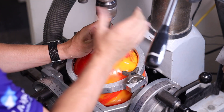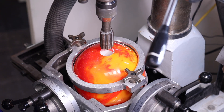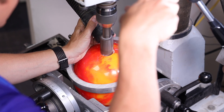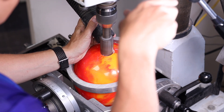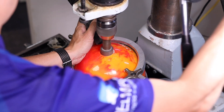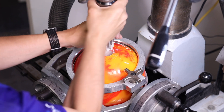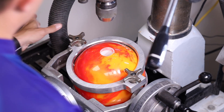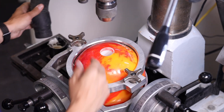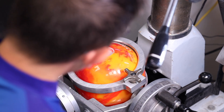Here's our reamer. The machine hasn't moved, everything's good. We're now going to use our reamer bit to make sure that the hole is 100% round. Be careful, it's going to make some noise. Now we have a perfectly cylindrical hole — it knocked off all of the trouble spots we might have had, making everything nice and round on the inside. We are now ready for an outer sleeve.